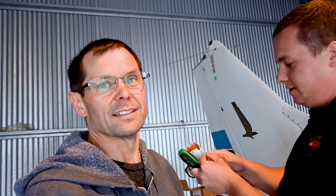When I did this, we went on top and found that the old cap for the position light was a little damaged — multiple pieces, just old, cracking. After 40 years of sitting out in the sun, the sun damages stuff. You can see how brittle this thing is — it just kind of comes off. I didn't want to mount a $2,000 piece of equipment to this rudder cap and have it come off in flight. It's original to a '77 Cessna, so it was time anyway. I had replaced all the plastic, the wingtips, all the fairing plastic, even the ends on the elevator. The rudder cap was the last piece to replace.